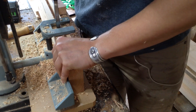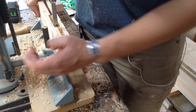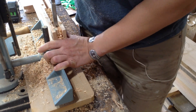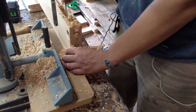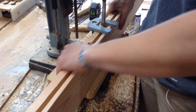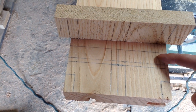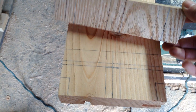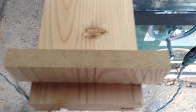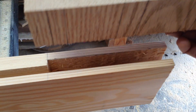The reasoning for the double tenon is that wide pieces usually use multiple tenons. Seasonal humidity will affect a single solid tenon a lot more. Also, I don't want to remove a ton of material from the stiles — it'll become a weak joint the more material you remove. By splitting the tenon in half, you're leaving a nice thick chunk of material between those tenons and preserving the structural integrity of the door. I already calculated the haunches and tenons on the rails, going down an inch and then down further to about two and a half inches.